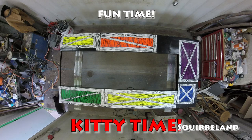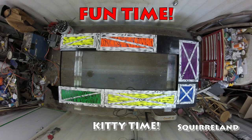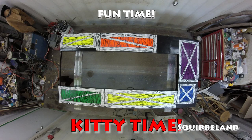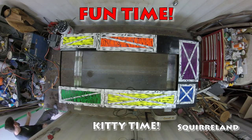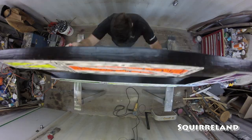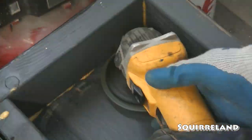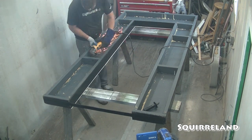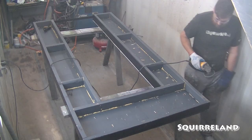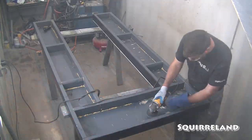For the past few months, I've been leaving some food out for a stray cat that has been hanging around outside my shop. It looks like today she popped in to check up on my progress and to make sure that I'm staying on schedule. She's missing the top piece of one of her ears, so I'm calling her Chip, but mostly she goes by Kitty. To finish up the last bit of work on the panel, I just need to grind down all of the nails sticking out of the back, clean up the strip of wood I had to add to the door frame, then primer, paint with one coat of flat black and two coats of semi-gloss, and hang the door back on its hinges.